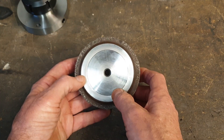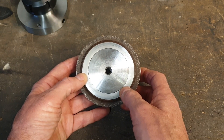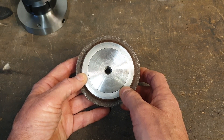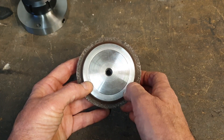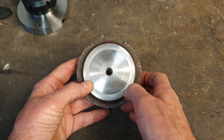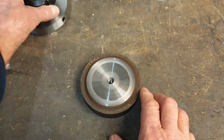I need to bore a 52mm diameter hole through the centre. Once I've got that hole bored I can then drill the three holes for bolting it to the spindle, and then I can mount it in the spindle to do the rest of the turning operations to actually fit the collet chuck itself.